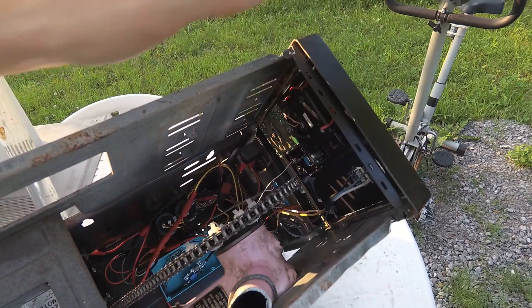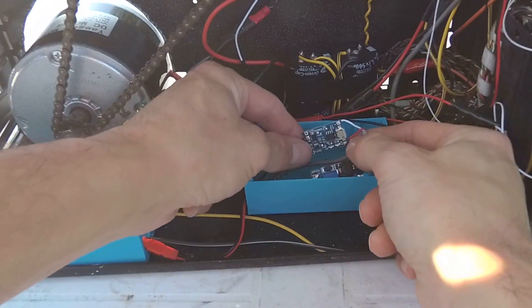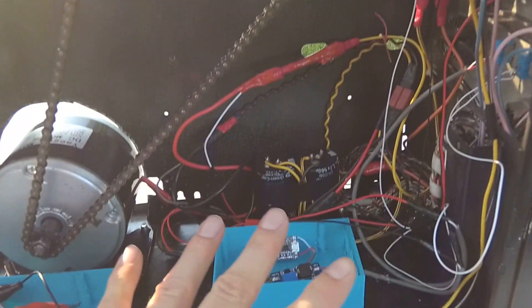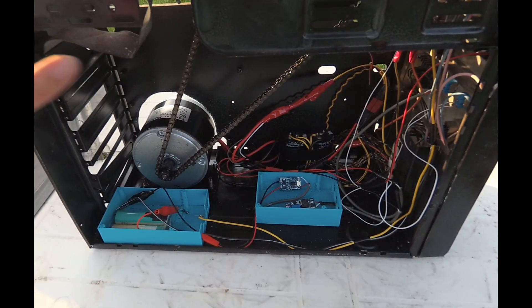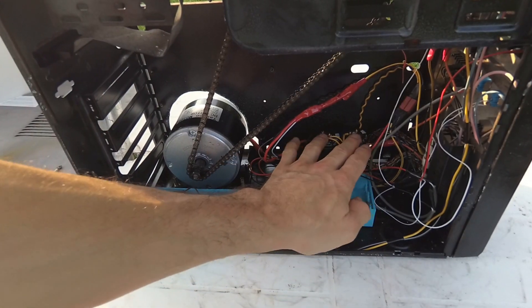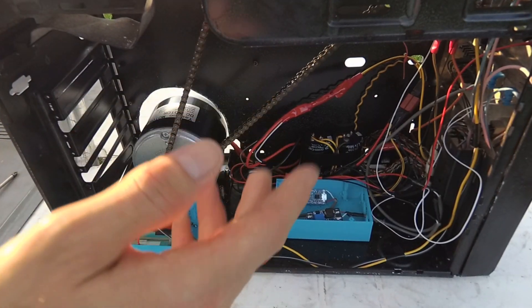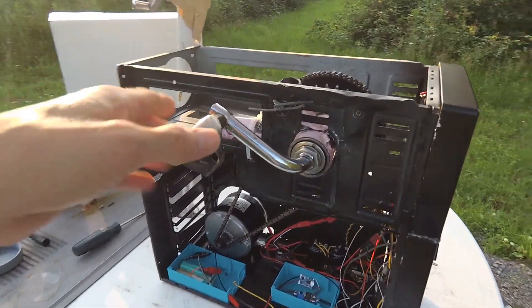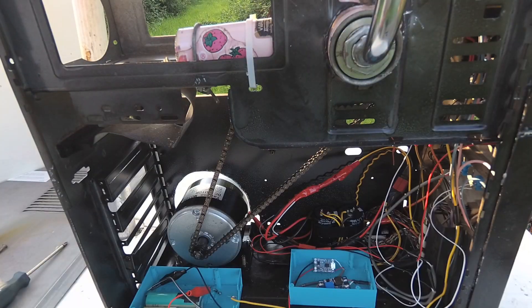The wiring is very simple — everything is just two wires: negative and positive on the boost module, negative and positive on the charge module, and negative and positive to the batteries. Everything in between is just switches. There are tons of ways you could build this with different components. If you want higher current, add more supercapacitors, more boost modules, a larger boost module, or a larger power bank module with a higher amperage output.